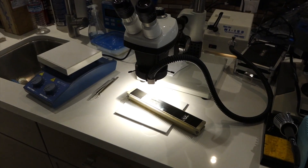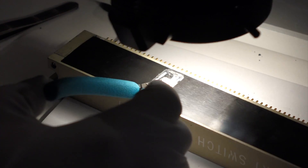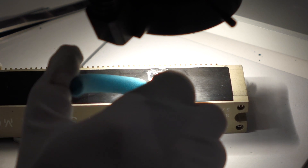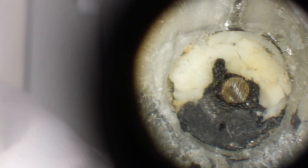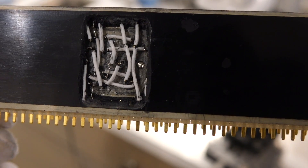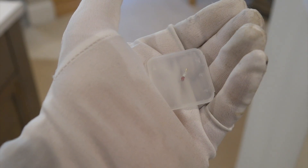I'm about to take the defective diode out of the module under the microscope. Snip. Clip. You can see here I cut the lead very cleanly. I have now cut through the plastic screen to get at the diode itself. The white material you see is very soft — I'm told it's some rubber silicone. So you might be able to pull the diode out intact. And one diode is out. The second diode is out. We might put it on eBay for anyone that wants to buy to support the project — and it's guaranteed not to work.